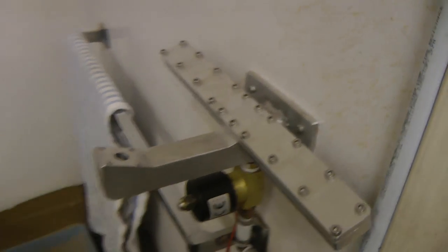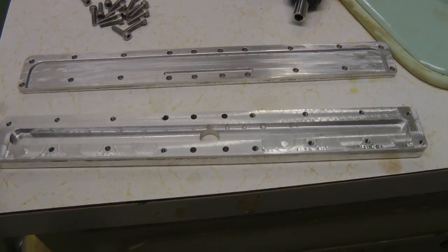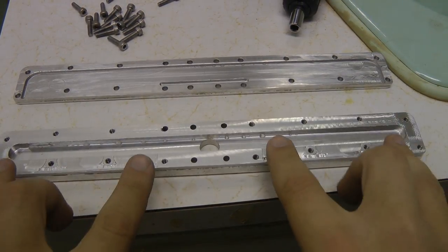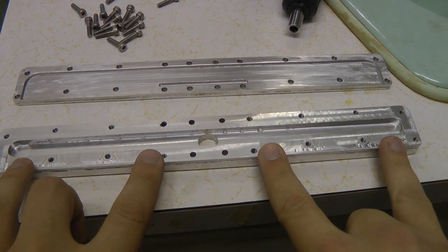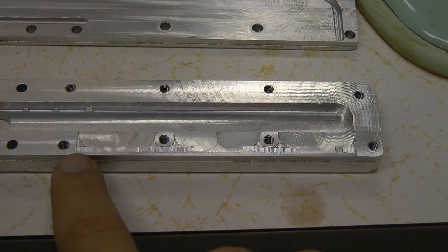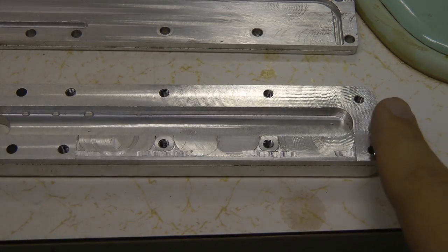With one of the nozzles off, we can easily see how the air nozzles are constructed. They're basically just a single piece of aluminum with an air channel milled down the center. There are two air nozzles, one on each side. The air nozzles basically consist of an area that's milled down slightly farther than the rest of the face of the nozzle.